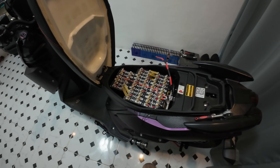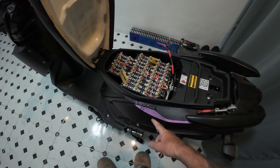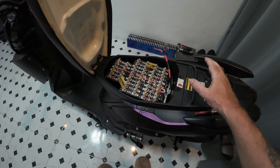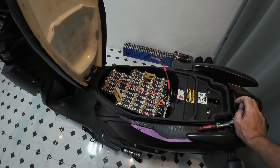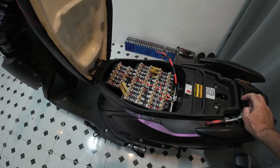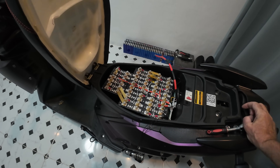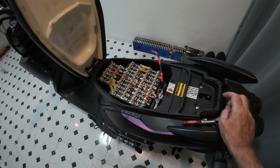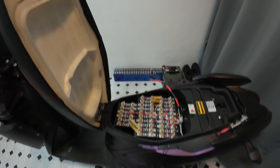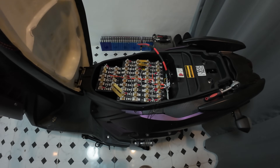On the top we've got cells 1 to 13 and on the bottom we've got 14 to 26. I ran this the other day until it was basically empty — it was saying about 20% battery. One of the cells, when it gets to about 3.1 or 3.05 volts, drops like a bloody stone. One of the downsides of these CATL batteries is you'll never get a matched pair. I've got all those down there making the best of everything I can; the rest go for solar, but for electric bikes they are pretty useless.